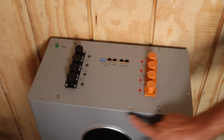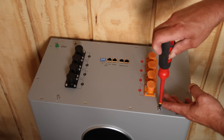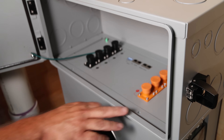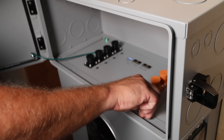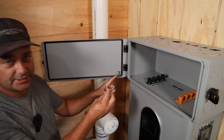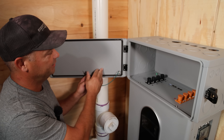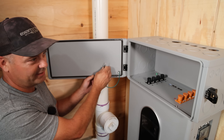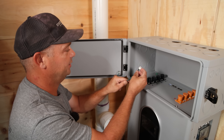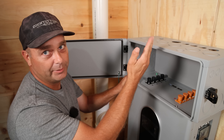Now go ahead and put on the conduit box. There are four screws — two in the front, two in the back — raised-up screws, easy to recognize. Take those out, set the conduit box on, and it's already pre-drilled to match those holes, so just put the screws back in and tighten it down. The door has a ground wire on it, which a lot of people miss with cheap enclosures — the door has to be grounded, the hinge is not a good bond. There's a green screw in the back that we'll attach that to.